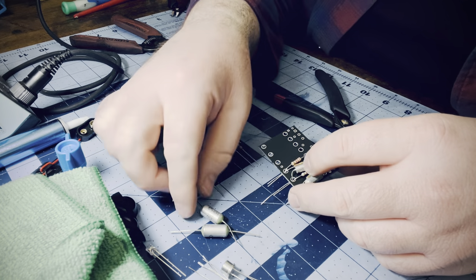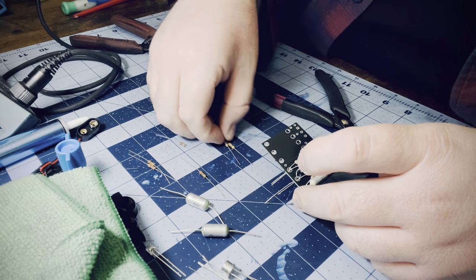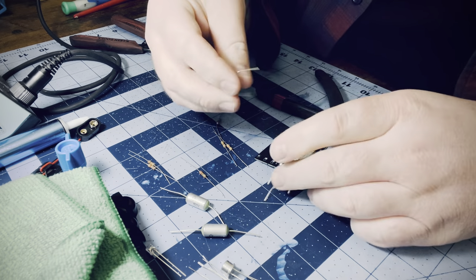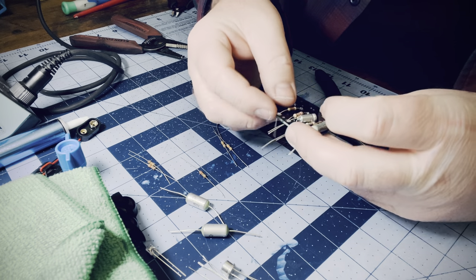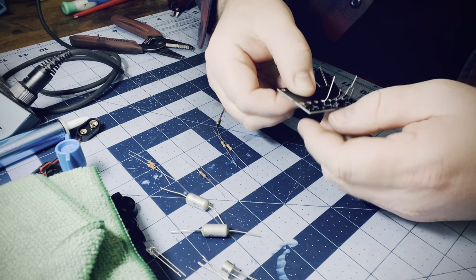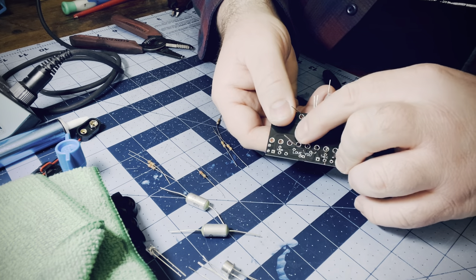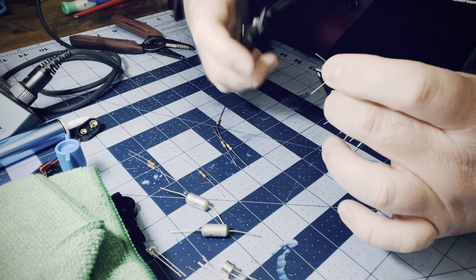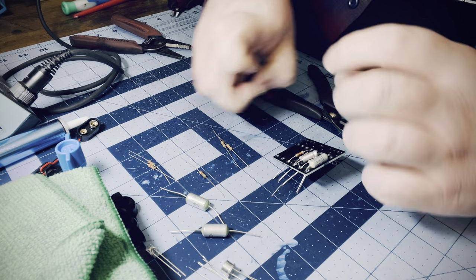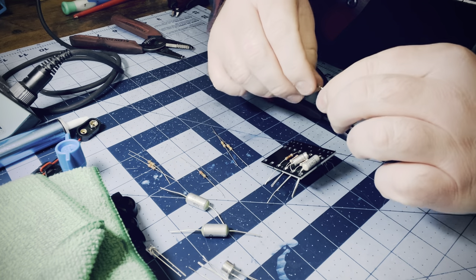The next one is this big cap, but we'll jump over to the next resistor — it's going to be another 8.2K. This comes off of the base of Q3 and goes down here — this is also ground. You can see on the back where that trace is, so it grounds that pad as well. Normally that would be hooked up with like a ground bus wire, but it's just streamlined on these with the trace.